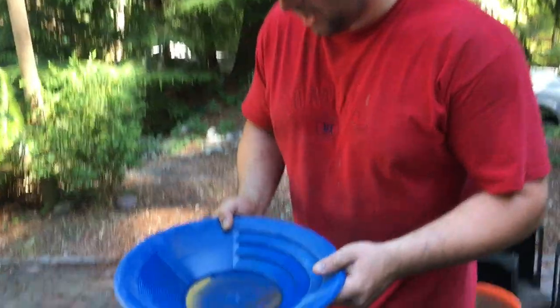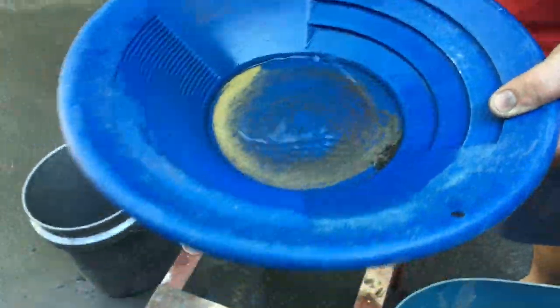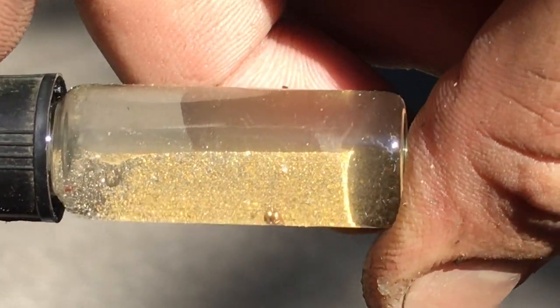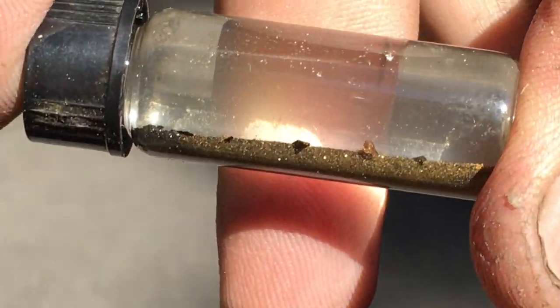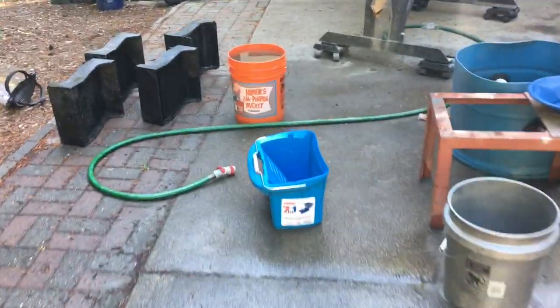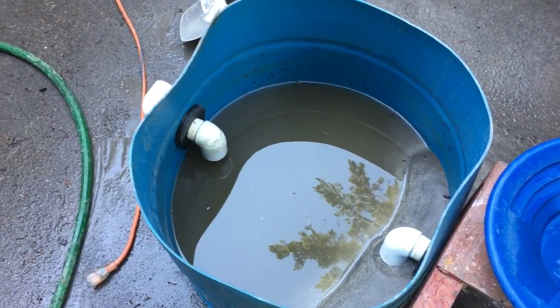All right, I'm done panning down the concentrate from the gold cube, and there is some really fine gold in there — it's a nice line and everything. It's at least a couple grams from that sample. Here's a vial with the concentrate that was panned out, and there's quite a bit of fine gold in there. I'd say most of it is sub 100 mesh except for that one little picker in the middle — there's probably at least a couple grams there. The test was a success. Got some nice gold out of it, so real excited about that. Stay tuned for the next video — I'm going to take those tailings from the gold cube and run them through a shaker table to see if we can get any more fine gold that the gold cube might not have captured. Thanks for watching, see you in the next video.